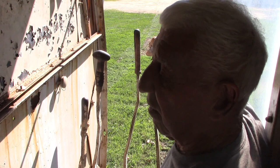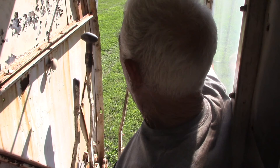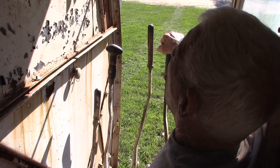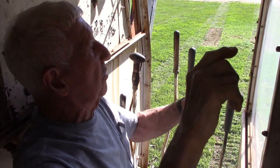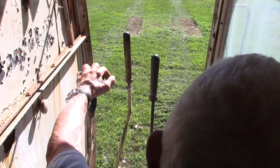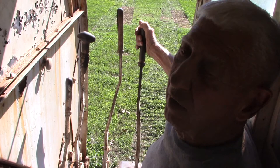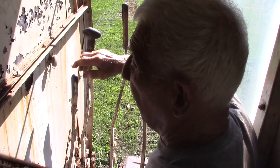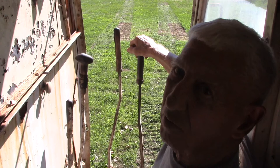These hydraulic machines are not as reliable — you take these hydraulic machines, they're not for sure. With hydraulics, before you pick up anything, you've got a chart and you have to go by that chart so you don't tip the machine over. To let the load line down on a hydraulic machine, you push the lever forward — but if you're tipping over, you can't get free fall. It'll carry the machine right over with it. That's why I tell guys with my hydraulic: when you pick something up and swing, stay within a foot or two of the ground — so if it does start to tip, it'll touch ground quick. These guys pick things up, swing around, start to tip, and it carries them right over.